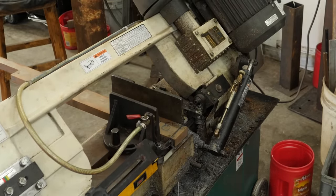I need to keep practicing setting this stone until I'm very confident I can do it on the real thing — I do not want to break that real black diamond or have it come out all crooked in the end of the pommel nut. Once I got the right size hole, I put the CZ in and take my engraving handpiece to hammer the metal close around it and hold it in place. The graver remarkably loves to sit right down in that groove between the diamond and the metal. Even though this isn't a real diamond, it still looks really pretty when you turn it in the light.